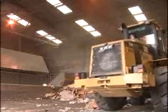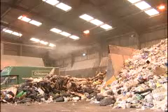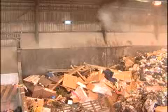Indoors can be a bit more difficult because of air movement within, say, a transfer station. But what you'll find is the best place to situate a Probe atomiser is often on the back of the building, spraying towards the openings, the doors of a transfer station. So what you're trying to do is create a vapour blanket again over the waste that's in that transfer station. That will prove to be extremely effective and won't be that affected by the air movement within the building.